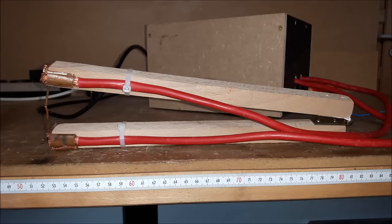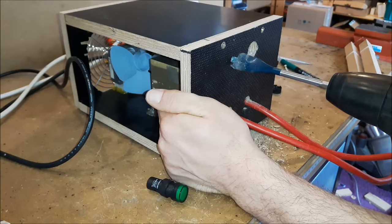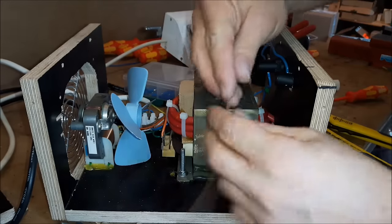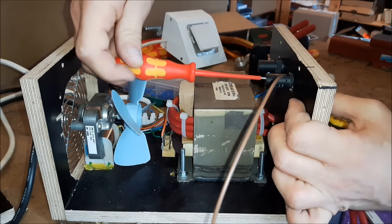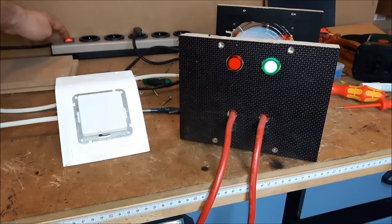In the meantime, my indicator lights arrived and they have to go in also. That means opening up the enclosure again and drilling some holes. The next step is to wire both indicator lights as described before. I have to admit this looks a little bit messier than before, but I had to have these indicator lights. With both lights connected, it's time for another test — green means power on, works; and red means weld in progress, works also. Both lights need a description label.